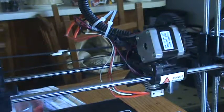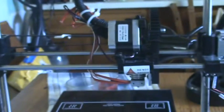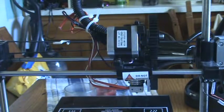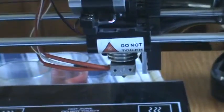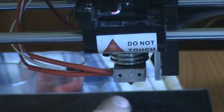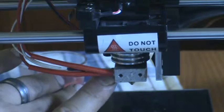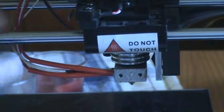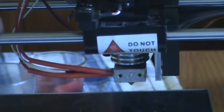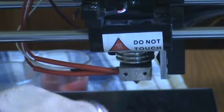One point I need to make: if you see how the wires go into the printhead - the heat block versus the fan - the reason I have it sitting this way is that the cooling fan would blow too much on the temp sensor and tell the program that the printhead wasn't warm enough to print yet, or for your pre-heat settings. It will still do that facing this way, because you see these little black allen head screws? They are missing, technically.